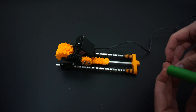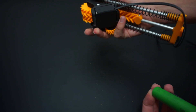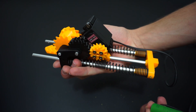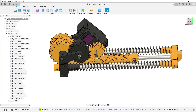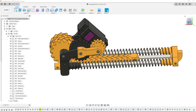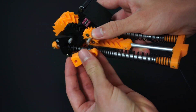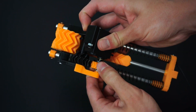Okay, so it seems that we have a small problem here. It looks like the servo mount is too flexible, which causes the gears to skip. And that is actually a quite serious design flaw, but I may have an easy fix for it. So I opened Fusion 360 again, and I designed this tiny part that should keep both gears tied together. And luckily when I mounted it in place, it fixed the skipping problem — but it's just a temporary solution for now.